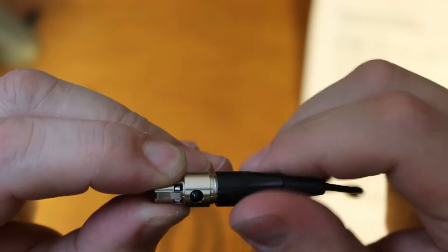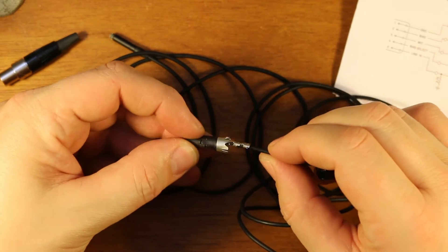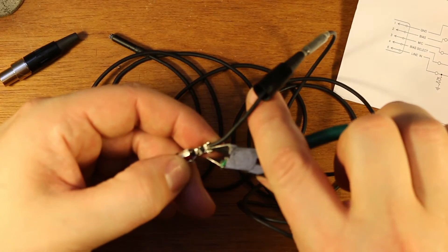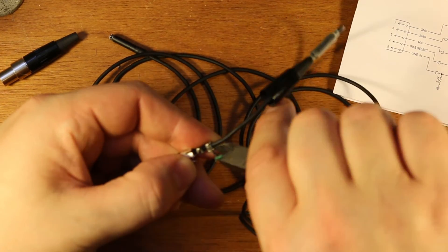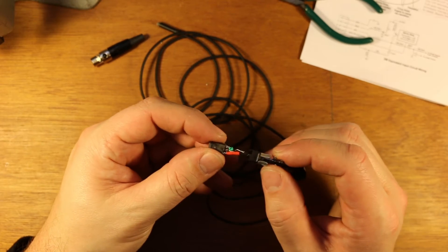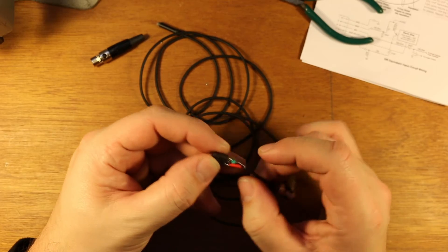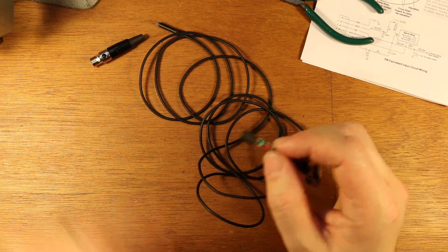The way to get this thing open is very easy — you just unscrew this part. As you can see, there are metal tabs here on the connector that are folded over, clenching the wire. I usually start with mini wire snips to get under the metal edges, since they have nice little sharp points. Be careful not to stab your wire. Now the tabs have been bent back open so you can pull it apart and it exposes the wires inside. I'm going to desolder these to get them all free.